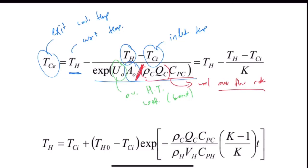And then also how quickly do you want to be churning out your beer? Because if you're okay having a lower production volume, then you can have a slightly slower process too. So you're going to get less product because your process is slower, but if you wanted to speed it up, you do it at the cost of more coolant flow rate. So another design consideration, as well as pump operating costs and capex to buy those pumps. So basically, we're seeing right here how economics is coming into this picture, and that's the reason why I love this. I think it's great.